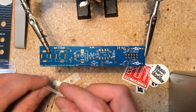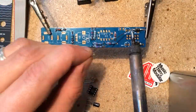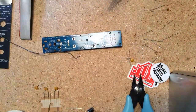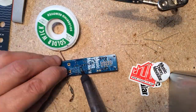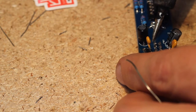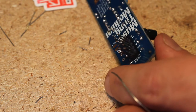I started with the usual suspects, diodes and resistors, making sure the solder looks good on both sides of the board, and that the diodes are correctly oriented. Then the IC socket, the caps, also making sure the polarity is correct, the fuses, and the power header, which goes on the back side of the board. When I added this header, I realized the space to solder was really tight. It would have been easier to have soldered it first, as per the online instructions. I did okay, but I do recommend you solder this header on first.